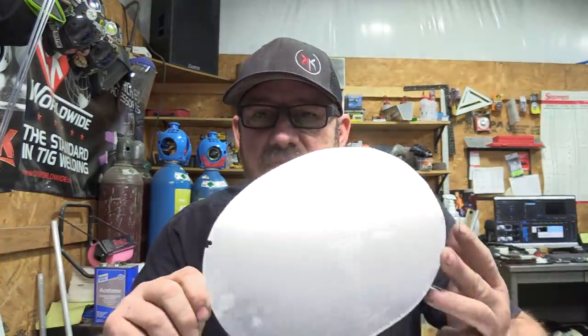So I got to thinking about, when I finished the end of the video, how do you practice for something like this without having to cut a bunch of test plates? This is what I do. So I plasma cut. I have a lot of remnant pieces laying around, random stuff I've cut. And what I'll do is I'll just prop that up on two blocks where I can raise it up off the table a little bit.